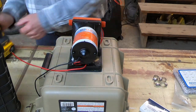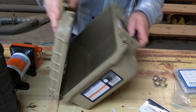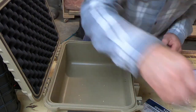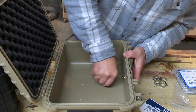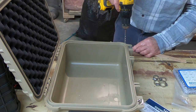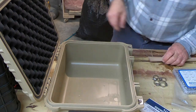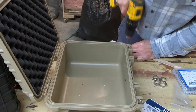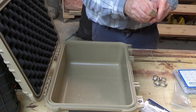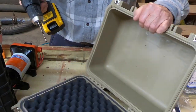Now we can see if that was a success. I'm going to turn it over and open it up — there are our holes. Our number eight screws are going in there, but the hole is not going to be big enough, so we're going to open it up with probably a three-sixteenths bit. You can always open the hole up a little bigger. We're going to go with an 11/64ths drill bit and open these holes right up.